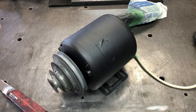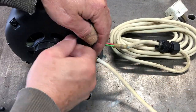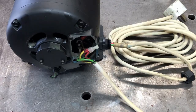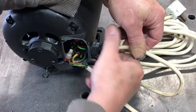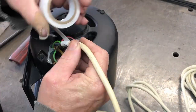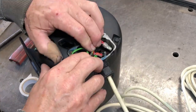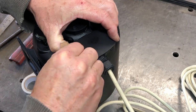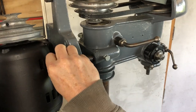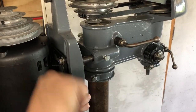Taking all the coverings off and the badge there as well. Now I work on fitting the electrical back in. There's the grommet that goes in for the power lead. The second one is a little bit tricky because there's nothing to hold it in, so I wrap a bunch of tape around it and that will stop it pulling through the casing of the motor. The motor is bolted onto the drill and the bolts are put on and adjusted. I'm using nylocks here so there's no chance for these bolts to vibrate loose.